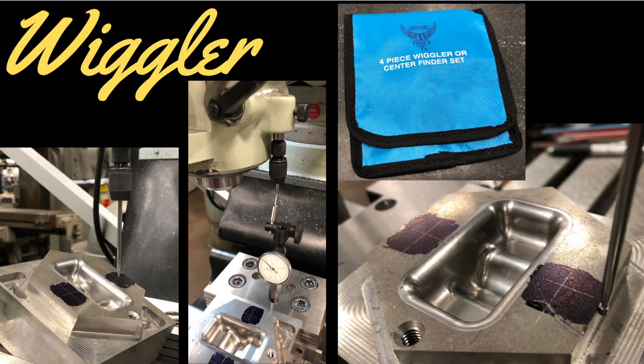Wiggler. I know what you're thinking — does anyone still use these? Yes, some people still use them. They're really good for if you need to indicate something from a distance where you're a couple feet away on large pieces of equipment. Today's video I'm going to cover some of the attachments and how to properly use a wiggler. I'll cover the ball-to-ball attachment which finds the center of a hole and the center of a block, the indicator mount, the disc which finds the edge or center of a workpiece, and the most useful — the point — which helps you pick up scribed lines, even on an angle.